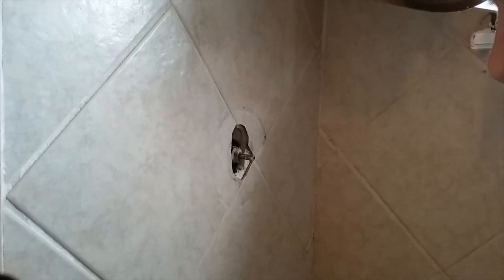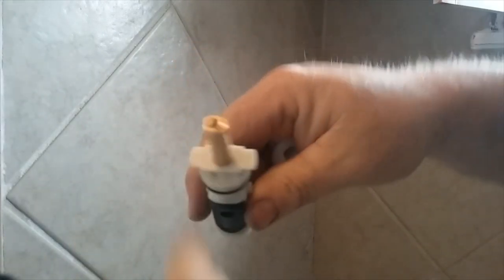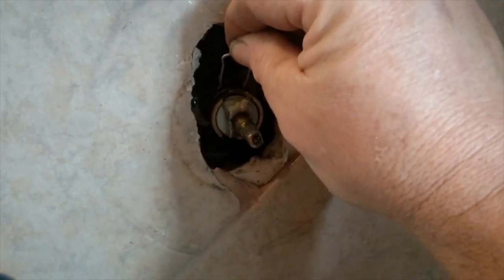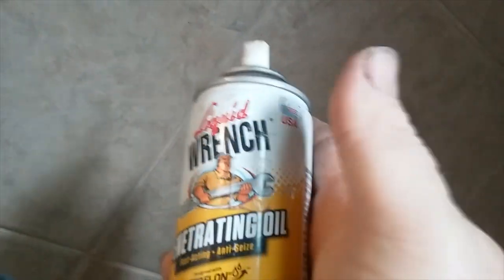I think it was $35. The Danco comes with a little tube of grease, but I recommend getting an extra tube of silicone grease. Now this little white cap is supposedly the tool you use to take it off — notice those ears right there. I had to break those off the old one to get it out. I did get the metal puller — I'm not messing around with the plastic. This is the clip that holds the cartridge in. Some of them are flat metal; in fact, this is the first wire one I've ever seen.